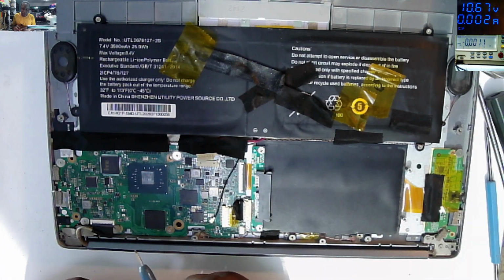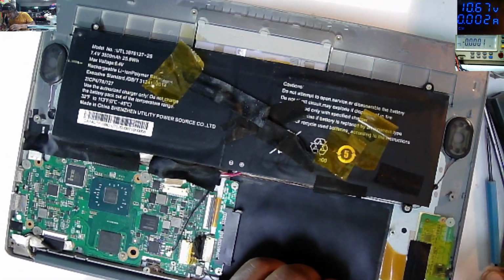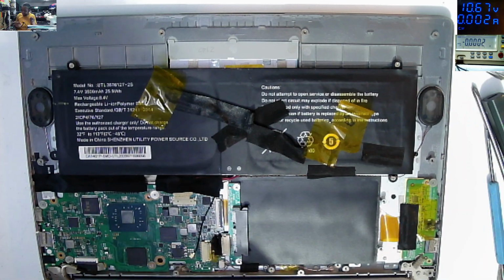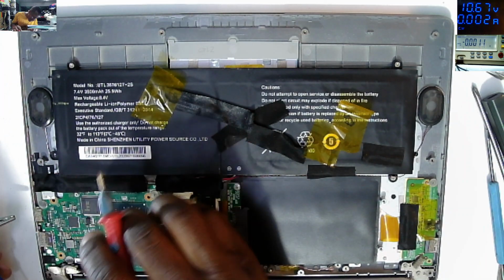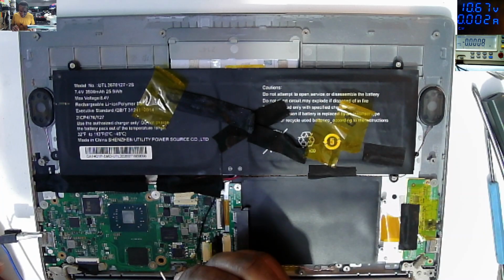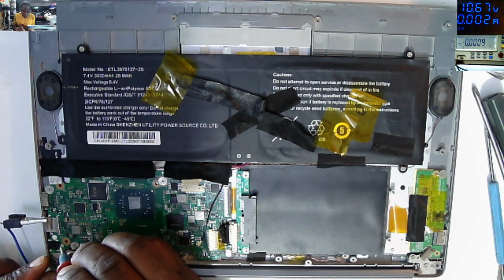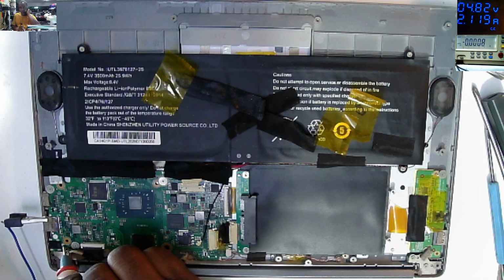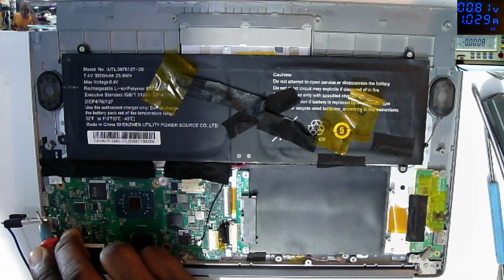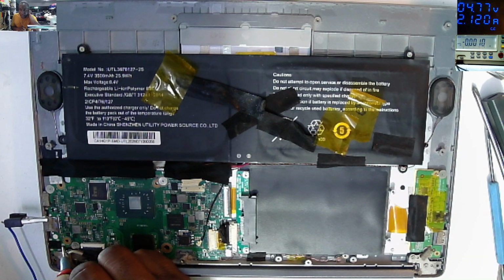You know, I don't trust the test meter. So we have to use power supply so that we see what's going on. How much current is being taken by this board? From there we can conclude a lot of things. That's connected. Let's go on the plus. You see, there's voltage drop to 4.77 and it's taking, how much current limit did I set here? 2.1 amps. And it's taking max current 2.1. You see on the screen?